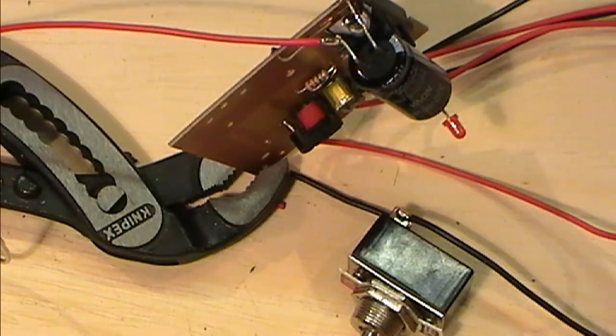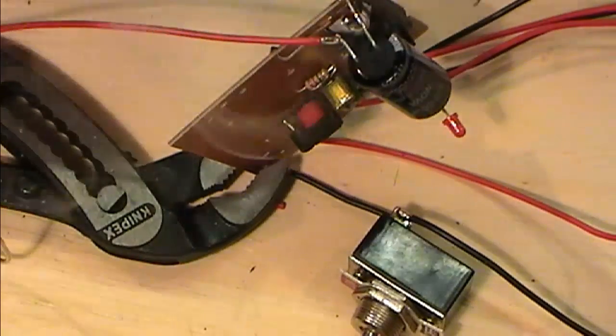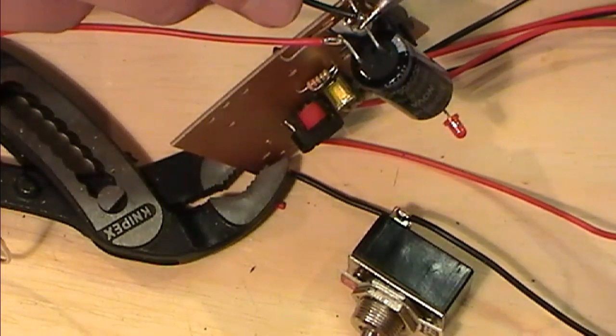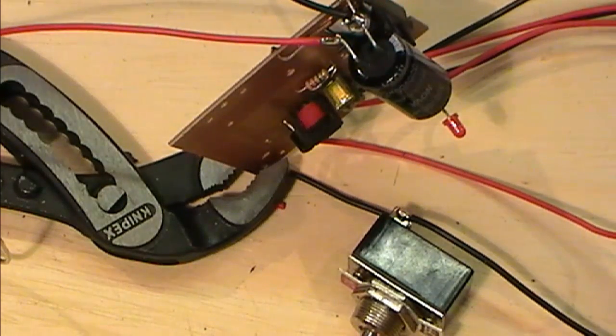So my pos wire is going to be going on my pos leg. And what I'm going to do, actually, I'll chuck the two on. You just don't want these two to touch realistically yet. You don't know if there's any residual current or residual charge left in that capacitor. Mind you, it shouldn't, because we're not pressing our button.